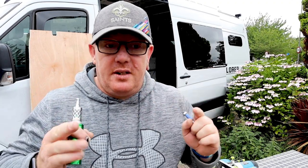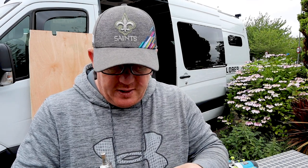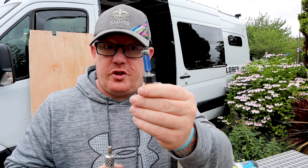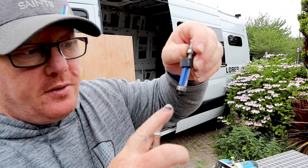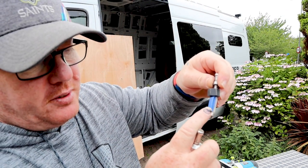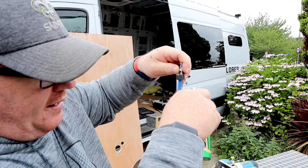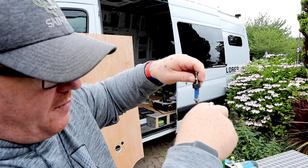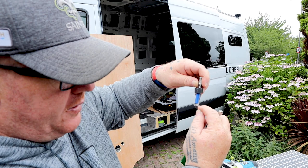Right, so basically to route the hole out for the window, we're going to be using this, which is a 1/4 inch flush trim bit in the router. What it does is, there's a tiny little ball bearing wheel at the bottom there. This ball bearing wheel you'll level up with the side of whatever you want to cut it to. So whatever is above that will then come down to meet this.